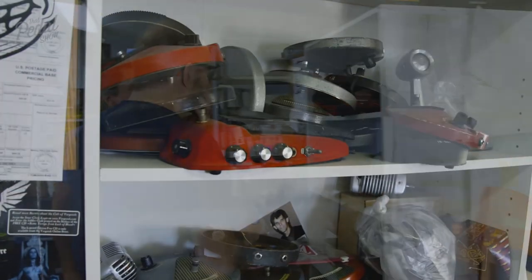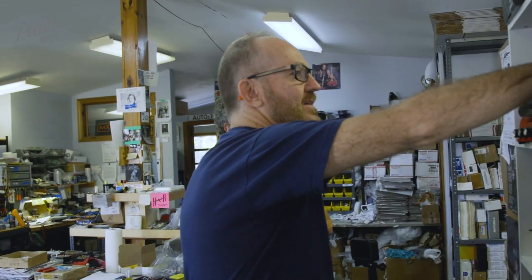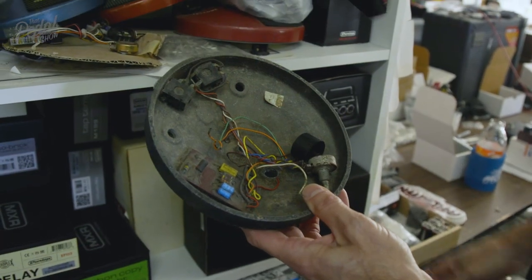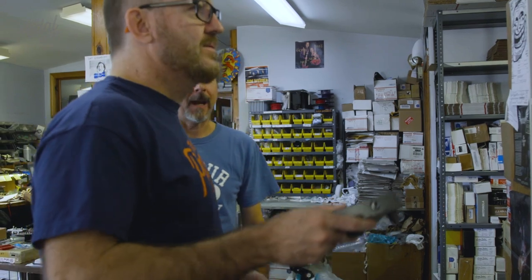This is what everybody gets mad at — my fuzz face panel. People don't like how I treat my fuzz faces, so I just keep piling them up. Of all this lot, what's your favorite? All the old fuzz faces I have, about 80% of them don't work at all, and the 20% that work, none of them really sound that good. I get these on trade and collected them over the past 20 years. The resistors drift, the capacitors get dry, mostly the transistors will die. We're going to get into the whole fuzz thing, because there's probably no one else on the planet who knows more about dialing in the perfect fuzz tone than Mike.